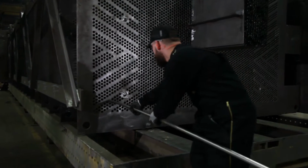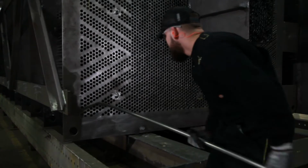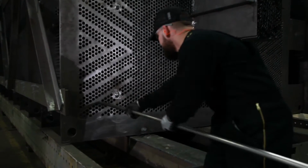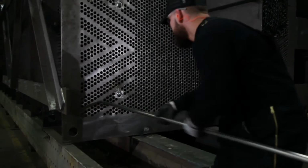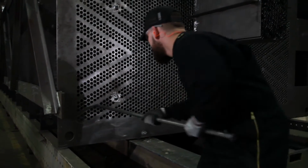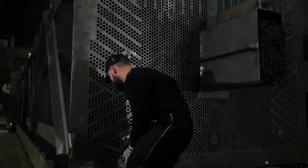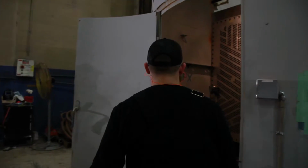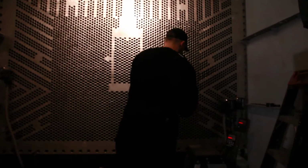The integrity of the EcoLayer steam surface condenser is dependent on the quality of the tube end welds which attach the stainless steel or titanium tubes to the tube sheet. During the production of EcoLayer condensers, hundreds of tubes are manually inserted into the tube support framework. Once tube insertion is complete, a tube end welding enclosure is attached to the end of the condenser tube sheet.